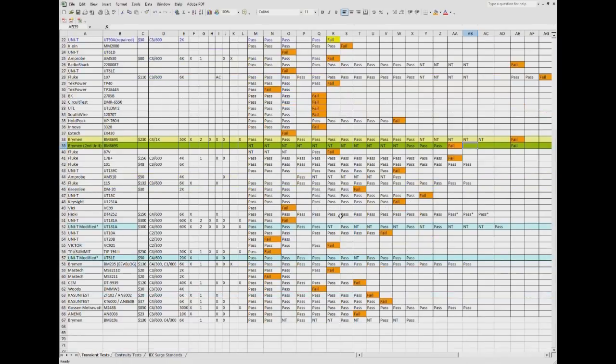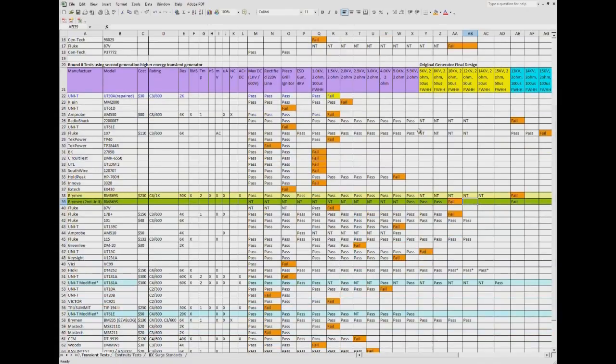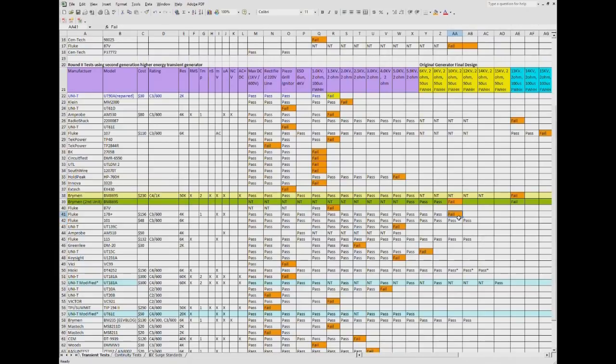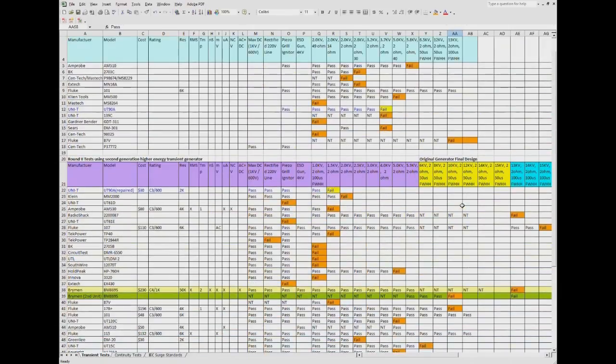But if we have a look at all the other meters where they failed, you can see very few make it up this high. As a matter of fact, the ones that have, we have the Fluke 107. We can see the Fluke 17B Plus had failed at this same level. The Fluke 101 has survived. The Fluke 115 has survived. This is the same voltage where the Hioki meter I've got started to break around the plastic. Looks like another meter that passed this test was the Brymen BM235. And the last one is our Gossen Metrawatt M248B. That's certainly my most expensive handheld meter.